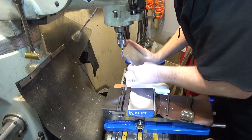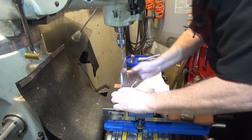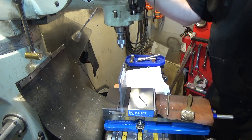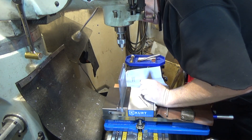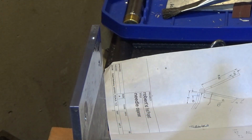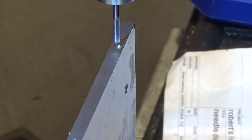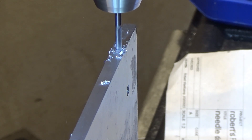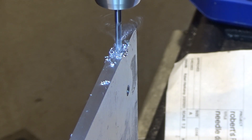To keep the spacing symmetrical I'm going to keep the reference to this side. Look at that - that is not the same. What the heck? Oh, I flipped it around - it should be right on the money but it's off. To make up for the bad countersink hole position, I'm going to use an eighth-inch carbide end mill to start the hole.